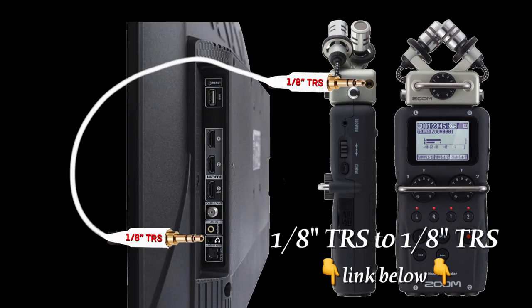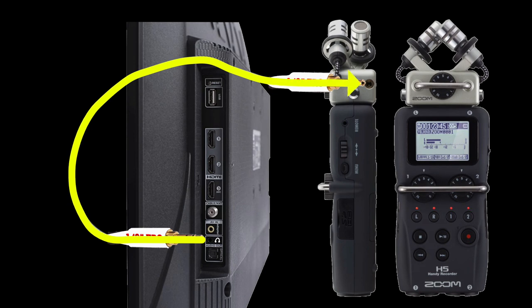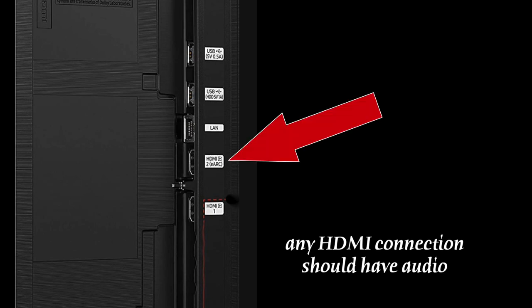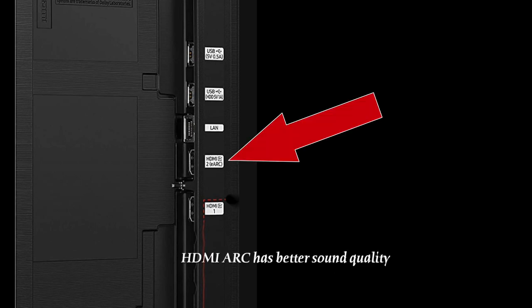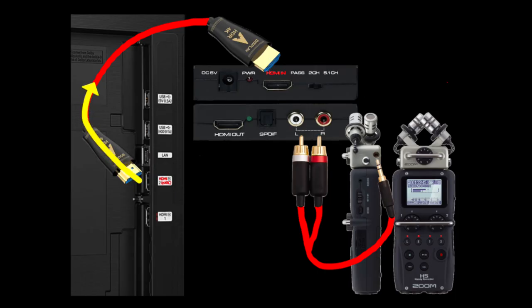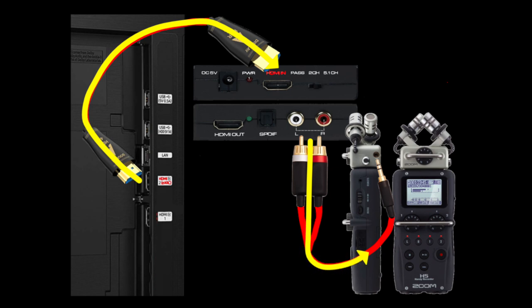For a television, take the headphone output — which is 1/8 inch TRS — and again with the 1/8 inch TRS, go into the Zoom H5 input on the mic capsule. If you have a TV that doesn't have any audio outputs, use your HDMI output. The HDMI ARC is typically HDMI with sound. You'll need an HDMI adapter — run your HDMI ARC from your TV into the adapter input, then run the RCA jack outputs from the back of the adapter into the 1/8 inch mic capsule input on your H5.